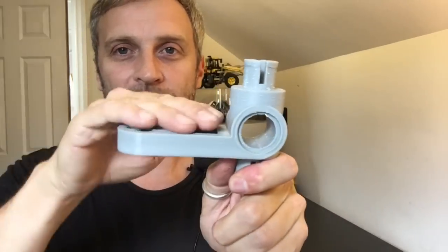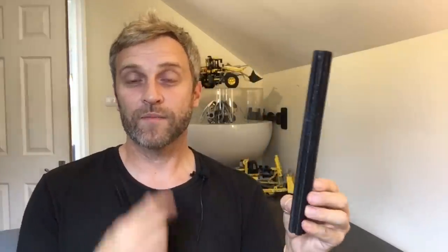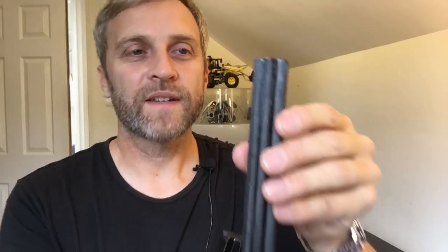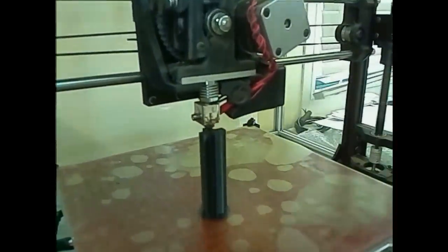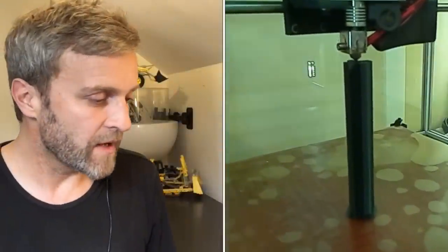The steering arms and steering pivots were printed in two parts — one piece printed upwards, then the top tip screwed and glued on to make it simple to print. The axles I was amazed at how well these printed. I'd never printed anything this tall on my TAZ 5 before — I just thought maybe it'll work and gave it a go. You can see it's got radiuses on both ends, and it literally just printed straight up, very straight and true. It was incredible how well these came out.